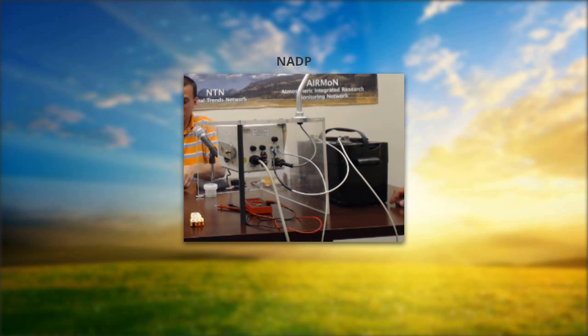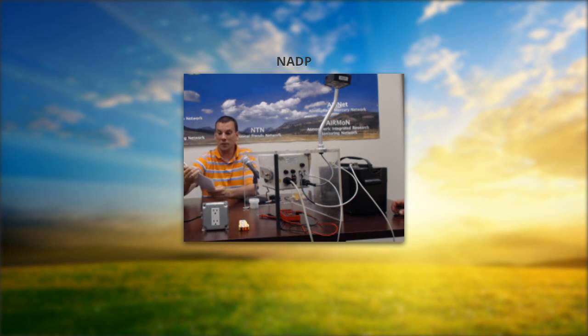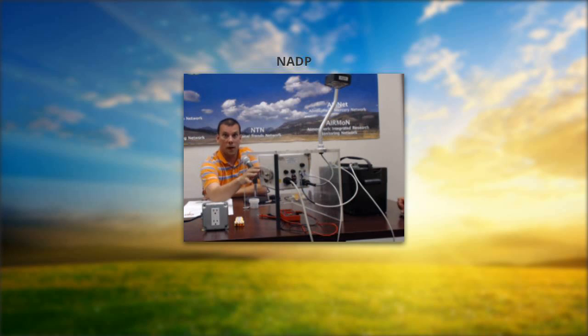We're switching gears to power troubleshooting — turning to the other handout with the multimeter on the front. Turning to page three on DC powering: the motor box provides trickle voltage to supply the battery, and the battery can serve as a backup when you don't have inline power, as we saw. We need to check periodically both the voltage coming out of the collector motor box supplying the battery and the overall battery condition. A battery can power the collector but still fail a load test — batteries lose capacity dramatically in cold weather and may not work well in winter.